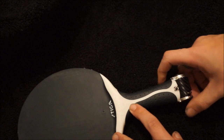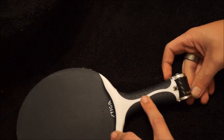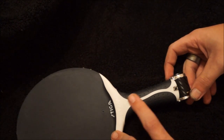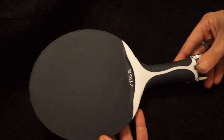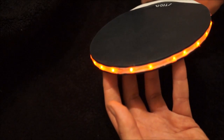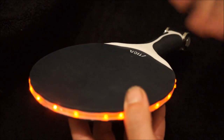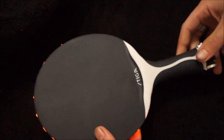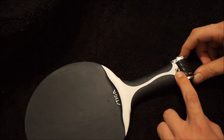And then one of the other changes I made is that the Hasbro children's version uses a very simple swing sensor. It's basically just two switches with a metal ball stuck in between them. I actually deactivated the bottom side of that switch because it's way too sensitive. And so now you get swings basically by swinging up, or from up to down, really hard. That way it doesn't keep swing activating when it's just sitting in a default position due to slight vibrations, which was really annoying.